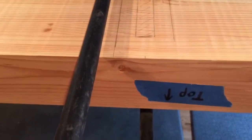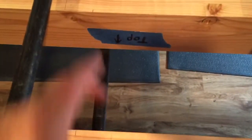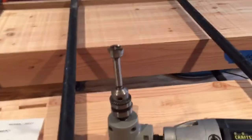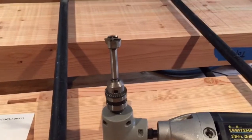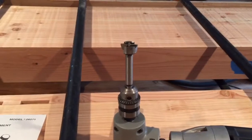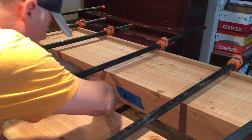What I'm gonna do right now is put some lag bolts right into the frame to connect these together — a total of six. But the distance in this hole here is too narrow for me to get a drill in there, so I went ahead and took the chuck off my regular drill and put in the 90-degree angle. That works, but I could not use a spade bit because it's just too long, so I'm going to attempt to use my Forstner bit, which does fit in here.